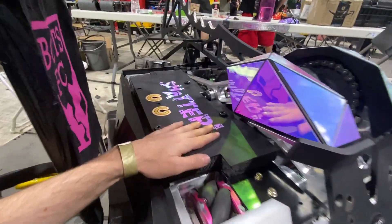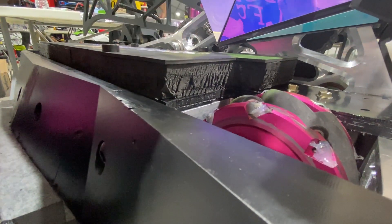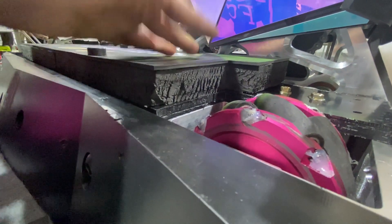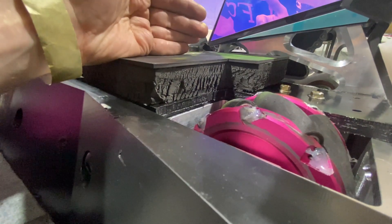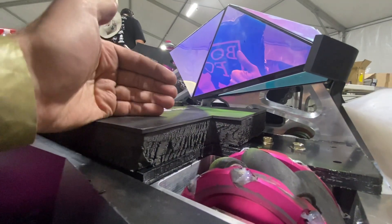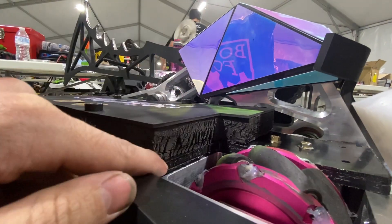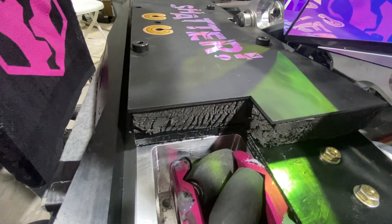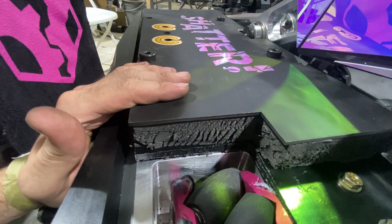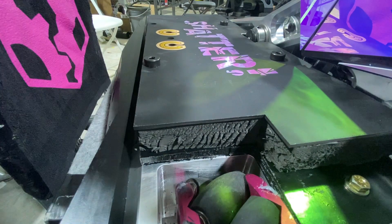Behind that, you'll notice another big change. This is AR500, about an eighth inch thick — that's a really hard steel — on top of an inch of foam. This should provide resistance from cutting, so hopefully it's hard enough to keep that blade from piercing. In combination with the foam, this should provide shock absorption, which will also lower the amount of force that the hammer saw is able to apply to the top panel. Underneath that are our standard half inch UHMW tops. So hopefully this sandwich we've created will provide enough protection from that Blacksmith hammer saw.